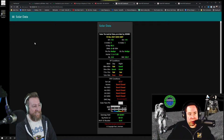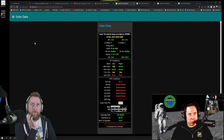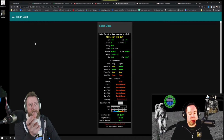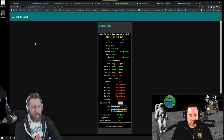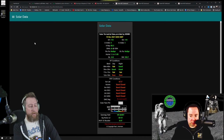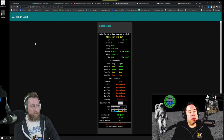First you need to establish a connection to your radio, right? So what you would do is get your Elecraft radio out. You would plug the serial port onto your Elecraft radio, and you would get an FTDI USB to serial connector. Most of them come with this cable. You're plugged in. And you would plug it into a Pi, into the serial port or the USB port of the Pi.